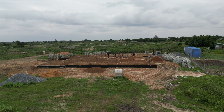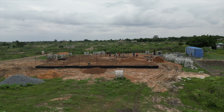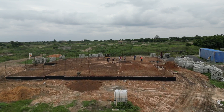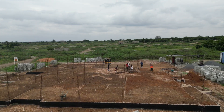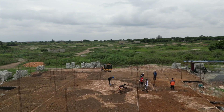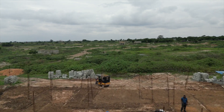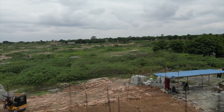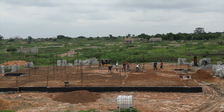It can either be a pass or a fail — they test it based on percentages. In construction, they're usually looking for 95% compaction or more to give it a pass. But when it comes to constructing homes, it's small scale — you don't have an airplane about to taxi or land on your home. So those kinds of tests are usually not done, although it's something you can do if you have the means to make it happen.